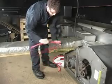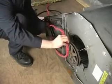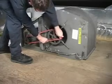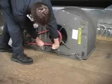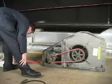Assemble the belt and turn the tabs to the inside. Place the belt on the smaller pulley and roll it onto the larger pulley. The belt will seem tight — that's okay. Check the belt after it runs for 24 hours and make adjustments to the tension if necessary.